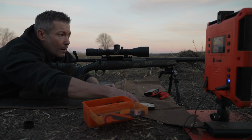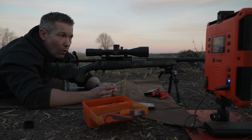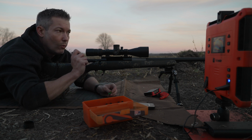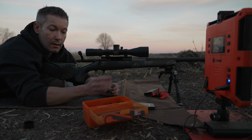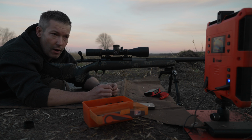I don't know what I'm going to do. The bolt click's not going to work for a hunting rifle, so I'm either going to have to try to find some custom dies, or I really don't know, because we're way under a stiff bolt where it's actually difficult to lift the bolt, and there are no ejector marks. The primers are still round. The primer pockets still feel new. This isn't a pressure issue.